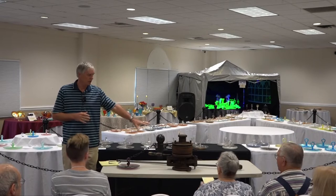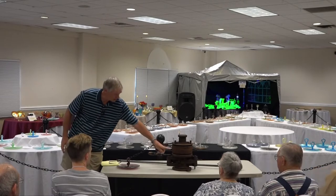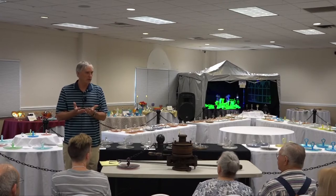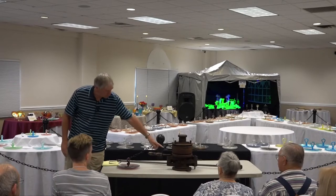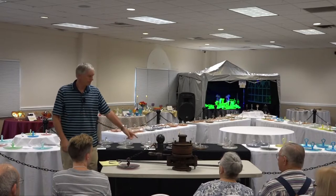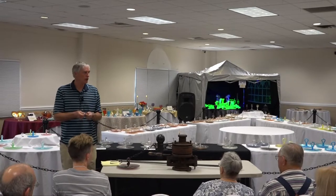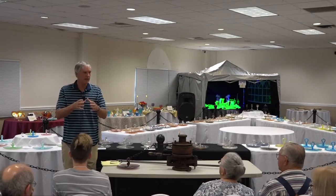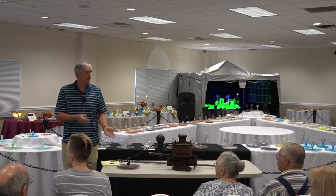It is a two-part mold. The top is what I call a shell mold. That's this part right here. It's a round, solid receptacle for the glass. You drop the glass in there and you press the glass out. It then goes through a hole in the bottom down into a lower mold that is the handle mold. It doesn't have handles on it. It would normally have wooden handles on it at the bottom, so you can open it up and get the handle out. Because as you'll see, when you have the glass coming down, you take apart the handle mold, otherwise there's no way to get the piece out of the mold.